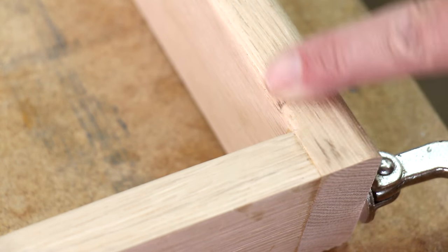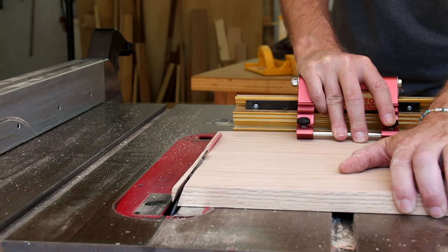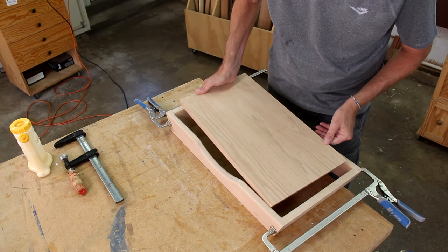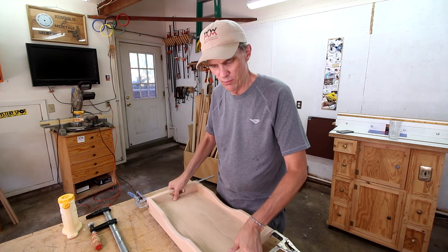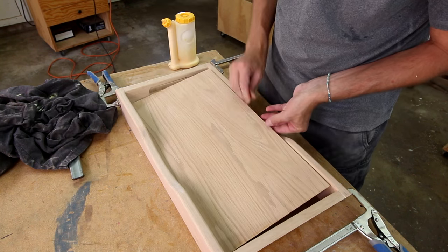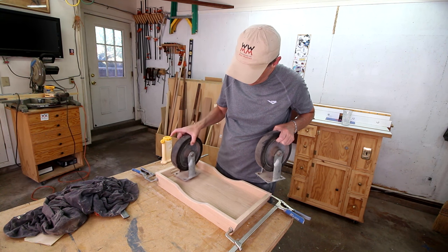Returning to my base, I'll bevel the two ends at 20 degrees. How short you decide to make this piece determines how far down it's going to sit into the tray. I think leaving a little bit of a lip around the bottom makes it look nicer rather than putting it flush against the bottom. I'll glue this on the ends only — it probably doesn't really need any clamping, but I'll put some weight on it.